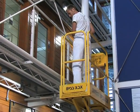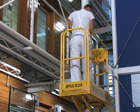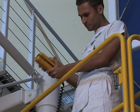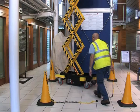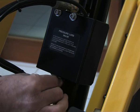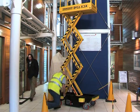When descending there is an audible alarm and a three second intermediate safety stop. In the unlikely event of a loss of power there is a simple two stage valve release process. The pressure loss valve is located on the hydraulic ram and the second valve is on the back of the base unit.